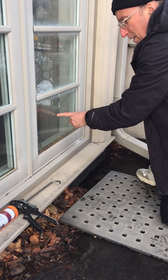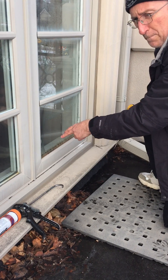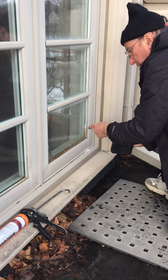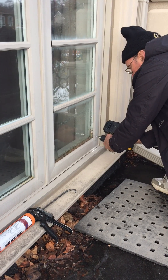There's condensation inside the sealed unit, but it's up high — there's no floor inside here, so it's gonna be hard for us to change the glass. So I'm gonna try a shortcut: drilling a hole through the corner of the glass with a glass and tile bit, an eighth of an inch bit, and I've already started it here.